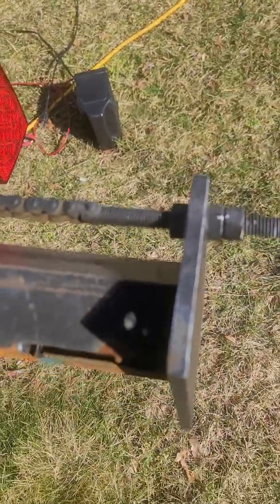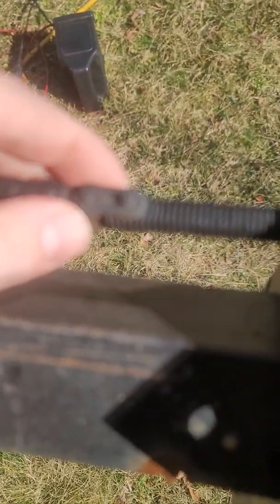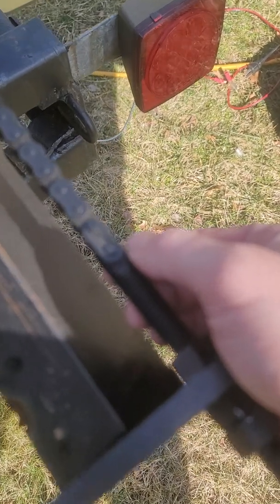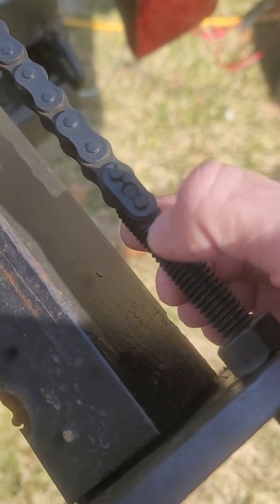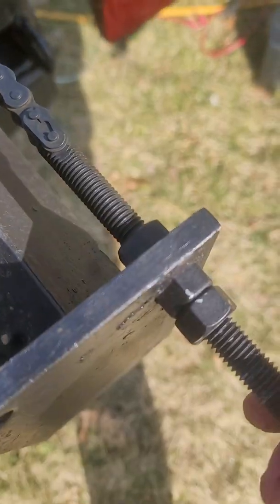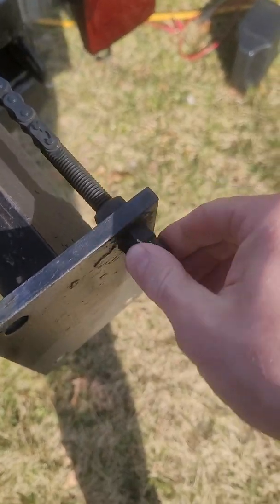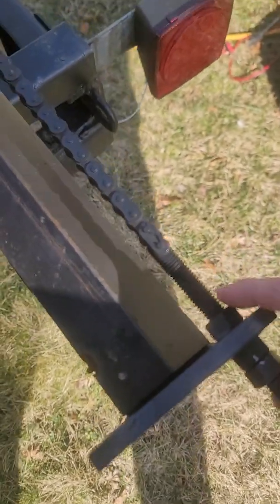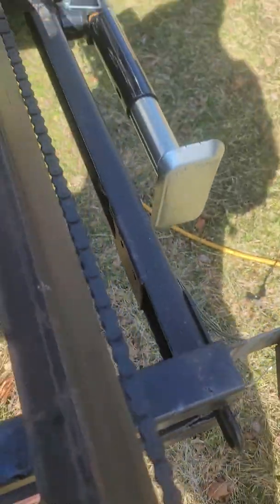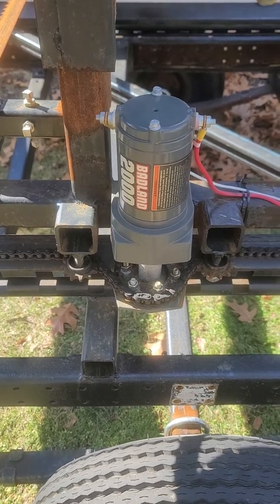On each end of the saw I have a tightening mechanism — just a bolt that goes through this piece of metal. I had to grind the bolt down a little bit, and I put a master link on the end here. I can adjust the tautness through this carriage bolt — you don't have to use a carriage bolt, that's just what I had. I put a couple of bolts on here to lock it in place. Ideally the chain probably would have been better suited rotated 90 degrees, but I had no other way of mounting my winch vertically in this situation.